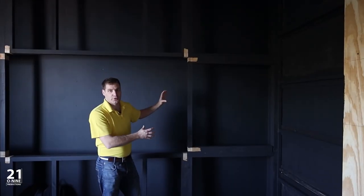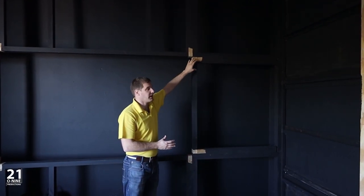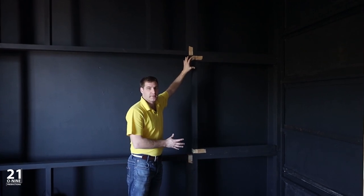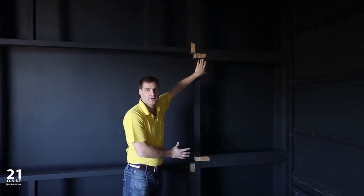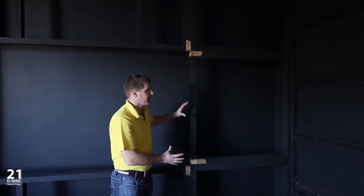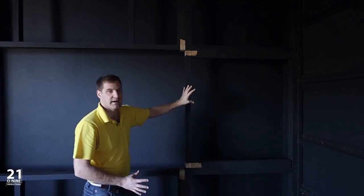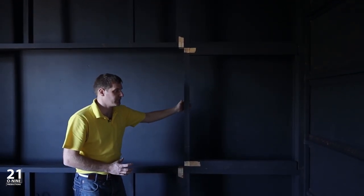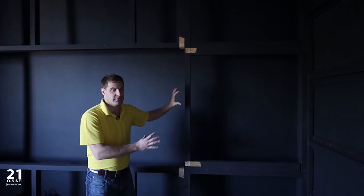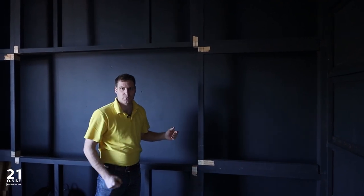This is a bit of a closer look at the front screen wall framing. Essentially, we will have our framing panels that hide all the speakers mounted up on some Velcro on this front section. So that allows us to place the speakers in the perfect location on the back wall, and you won't see where they're actually located. So this is the support that will hold speakers, it'll hold the TV, and then everything will get hidden by the panels that will get installed later.